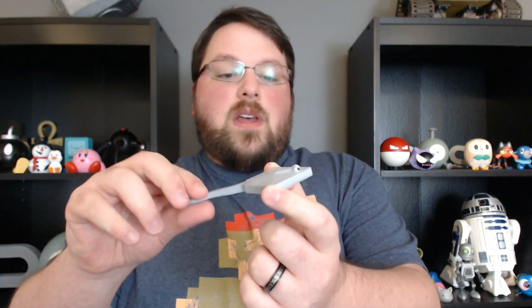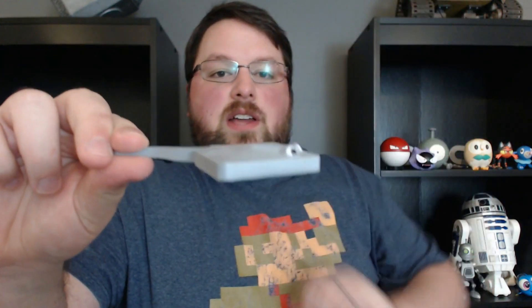Because if you don't turn on a really fine layer height, you'll be able to see the lines exactly where the layers are. So the first one that came out of the printer looked like a weird diamond kaleidoscope thing, and I really didn't like that. So I actually ended up going down to 0.05 millimeter layer height on my DaVinci 1.0 Pro for this one, and I think that actually came out pretty well — you can't see the layer lines or anything. Then my wife just airbrushed it without any sanding. And then while she was painting some other models, I went in with some paintbrushes and painted the white around the eye and then the black for the pupil — just with a paintbrush and acrylic paint and a not very steady hand. But I feel like that was kind of the spirit of these things: to get in and practice a skill that you've been wanting to learn and maybe aren't the best at. And painting is definitely that skill for me.